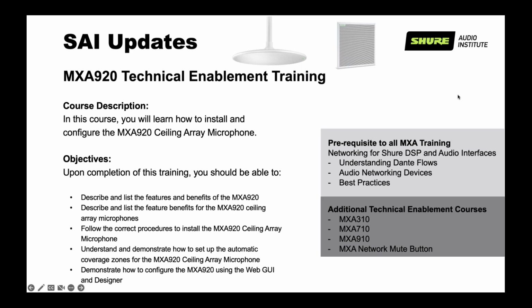With the P300 or the ANI USB or the IntelliMix Room, you now have an on-ramp and an off-ramp for all of those Dante channels. If you're a little bit more Dante advanced, then you know that in most cases, or in all cases, you would have to run the Dante Controller. If you're using a P300 or the IntelliMix Room, that's taking care of all of the routing for you. The software is doing the routing for you, so it takes place in lieu of the Dante Controller. Yeah. The idea was to not have you guys jump on 4 different software, right? Just to get a system working.